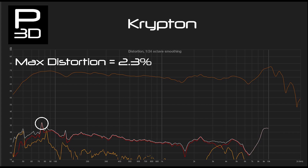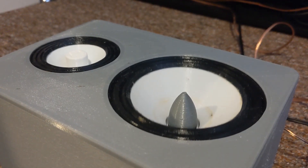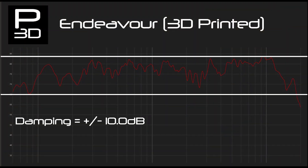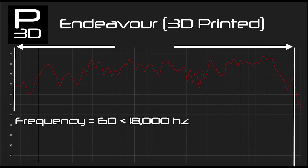So now onto the two-way speaker prototype Endeavor. First things first — the frequency response is give or take 10dB. This is slightly worse than the GAL build but not a bad result. High frequency response cuts off earlier, with the printed drivers achieving 18kHz — this is beyond what I can personally hear, but extension will still be worked on. Speaker response in the bass extension goes down to 60Hz, which is due to the lower sensitivity of the drivers and makes for a more full-bodied sound.